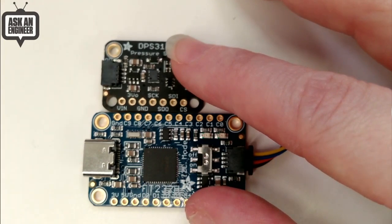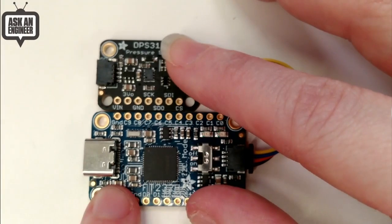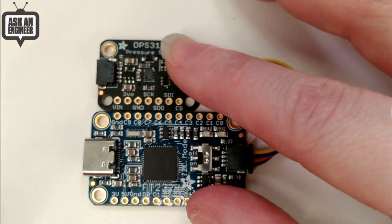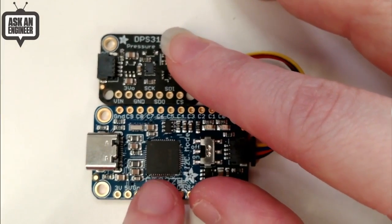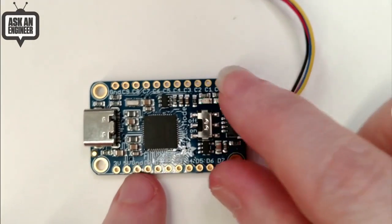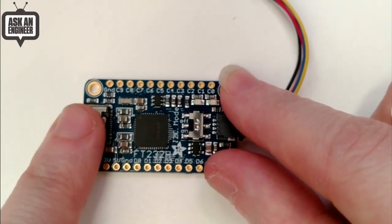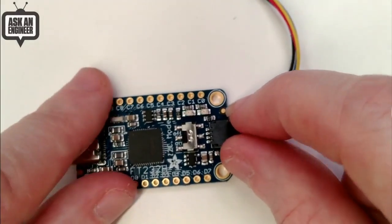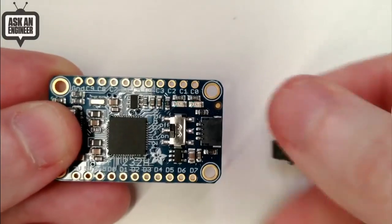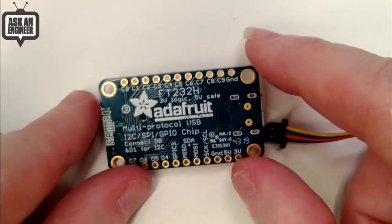Carter did a really amazing job getting a great guide on using all of our CircuitPython libraries with Blinka — which is the platform for running CircuitPython on CPython. When you plug this into your desktop Mac, Windows, or Linux computer, you can use all ~200 of our CircuitPython libraries to control sensors, devices, actuators, motor controllers, and more. Many people also use it for debugging: GPIO control, OpenOCD JTAG control, SPI at very high speed to drive a screen, and even controlling NeoPixels via a hack on the SPI port. We really like the FT232H and wanted to give it a proper remake.